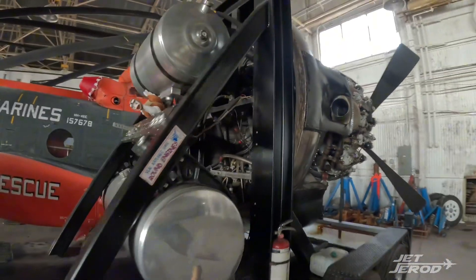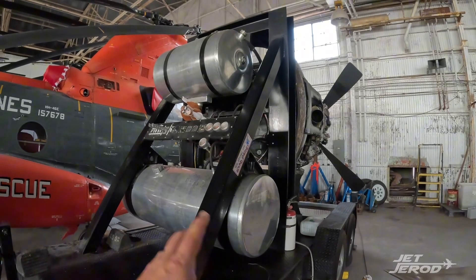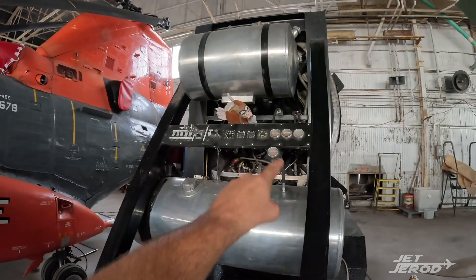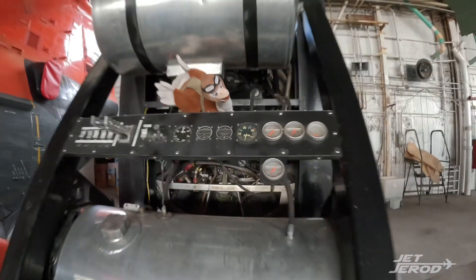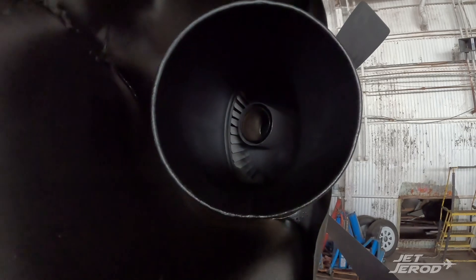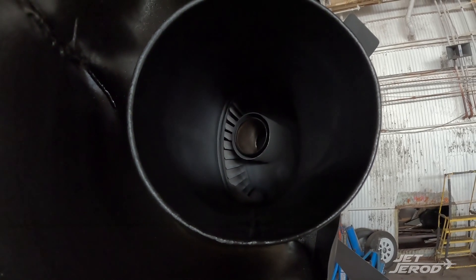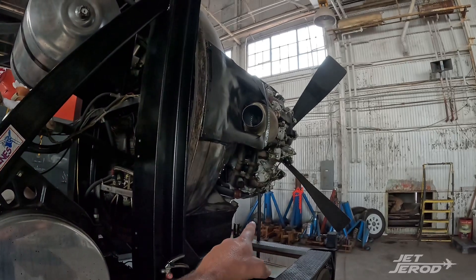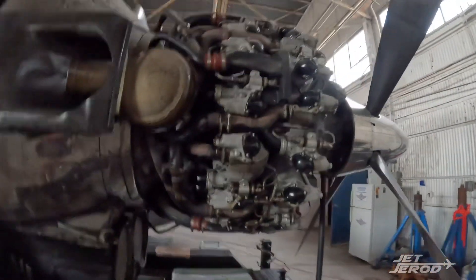Let's show you what makes this one of the most powerful trailers I've ever seen. Really all you need is oil and fuel and all the proper linkages, controls, wires, and hoses hooked up and you can pretty much start this thing. Ours is runnable — we've got the oil up there, the fuel here, and all the controls and gauges you need on the panel. You can actually see inside this PRT here — you can see the turbine blade up in there and the exhaust. The exhaust comes around, hits it at a certain angle, and then bleeds right in. The geometry of these exhaust pipes goes from basically a two-inch inside diameter all the way up, exiting to a six-inch exhaust.